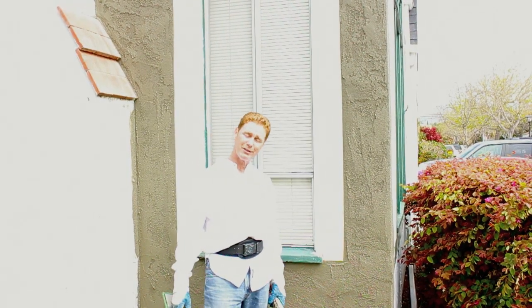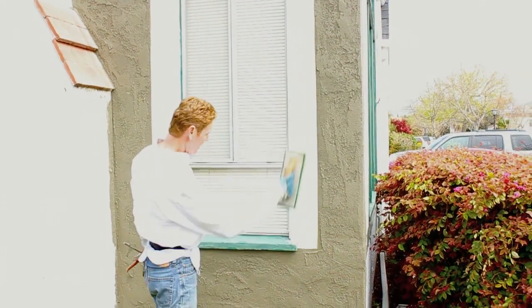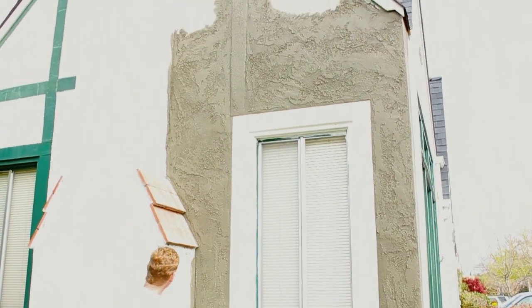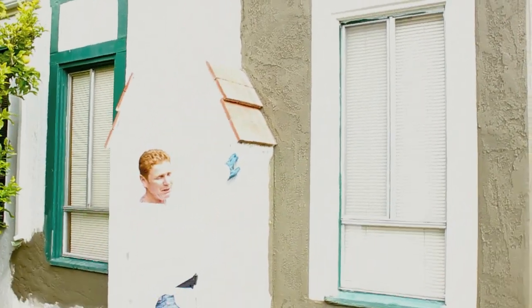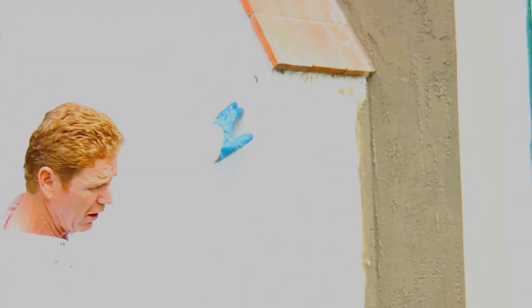Okay, folks, we're all set here. We were hustling, but we got it done. Here's the texture on this side. And the homeowner just came out and said, Kirk, can you put a little texture on this cracked wall while I'm here? I said, the fellas who did this work before us, they put texture over it. And it doesn't work when you do texture over a crack, because when the wall still moves, it'll crack right out. More flex is what I'm going to put in there. It's got a little bit of sand in here, so I'll put the caulking in here. That way, if that brick chimney moves again, it'll flex with it.